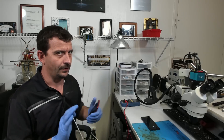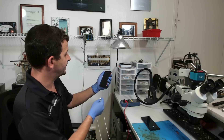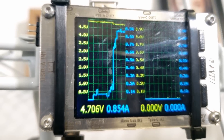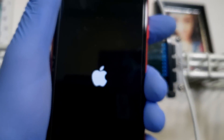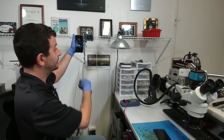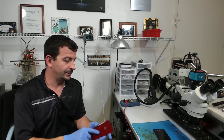I've got this phone all the way reassembled back up to the way it was when it first came in, and I'm going to connect a charger. We are now getting 0.6, 0.8 — we're pretty much drawing one amp of charging current and we have Apple logo. This phone is back up and running. We are at a lock screen. We have working touch. We have normal charging current and it is going to be good to go.